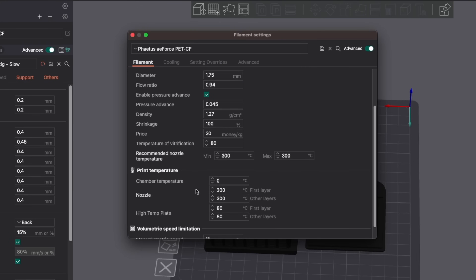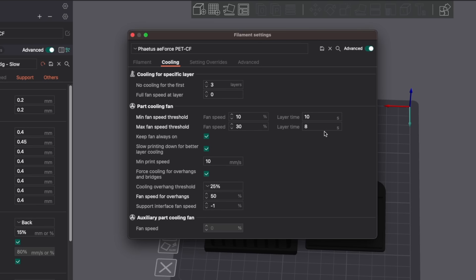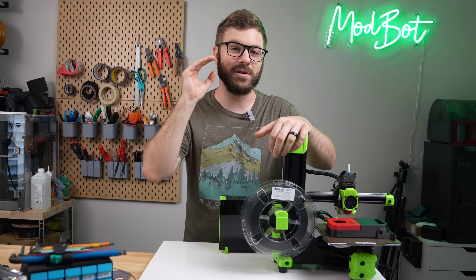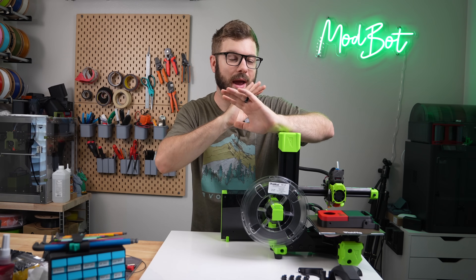In the slicer, I went with a bed temp of 80°C and a hotend temp of 300°C — in the middle of the recommended range, and many printers with all-metal hotends cap at 300°C in firmware. Retraction was set to 1mm at 30mm/s. FATIS does not recommend a layer cooling fan, likely to prevent adhesion issues, but I ended up enabling it at 10–30% on overhangs and bridging, which gave much better results for small parts and fine features. Print speed was set between 30–90mm/s as recommended; infill and inner walls at 90mm/s with 5K acceleration. I always recommend starting slow and ramping up once you're getting consistent results.